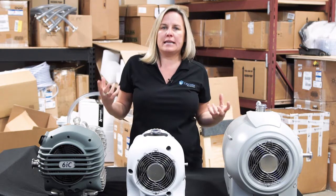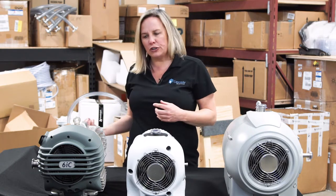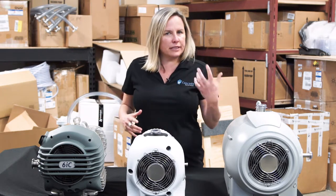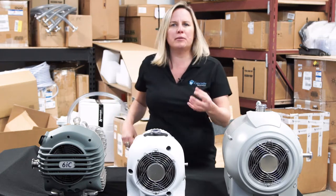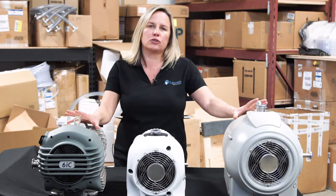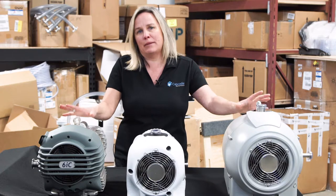The number one reason is that they are clean. They are an oil-free pump, so there's no oil to change. It doesn't smoke out the exhaust. It's a clean pump, and that's appealing for a lot of reasons. If you're making any type of human ingestible product, any type of clean room application, a nutraceutical, a pharmaceutical, aerospace applications — having an oil rotary vane pump tends to be a dirty application and poses a contamination risk for your process. So by going with an oil-free pump such as a scroll pump, you've already eliminated that major factor.